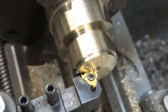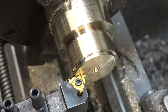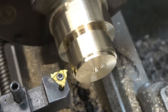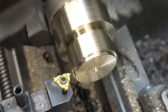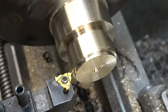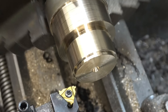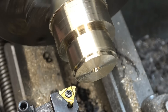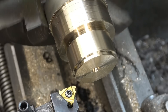We need to set the thread cutting tool up at 90 degrees to the job. It's simply done by holding it against the flat face. I know it's on centre because I use this tool in this tool holder all the time. All I'm going to do is touch the tool off and I'll zero the cross slide and I'll also zero my DRO. I'm not going to use the compound slide to put the cut on, I'm just going to go straight in with the cross slide — that's the way these cutters are designed to cut the thread. When it gets down to full depth it'll actually touch the base of the cutter, the flat bit next to the point.